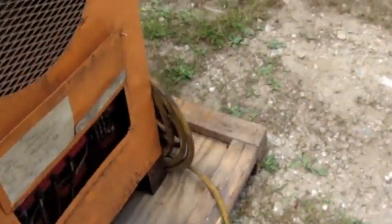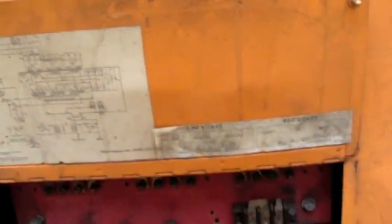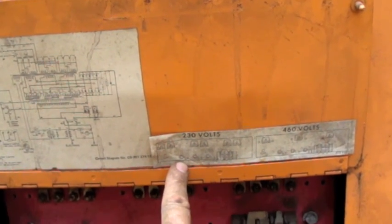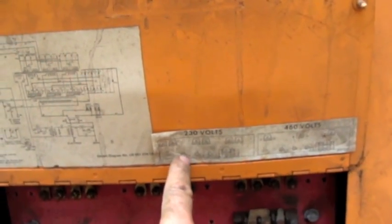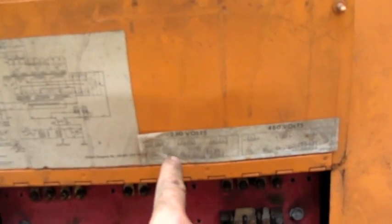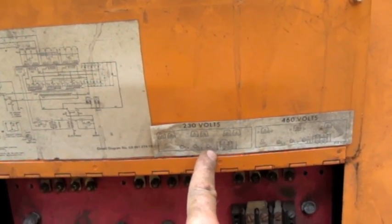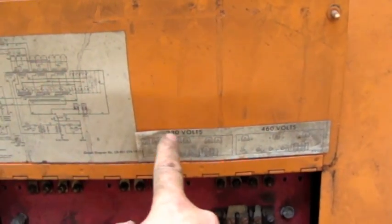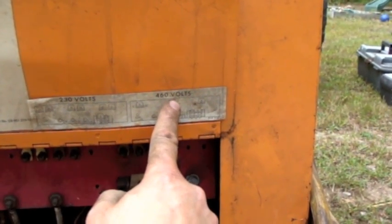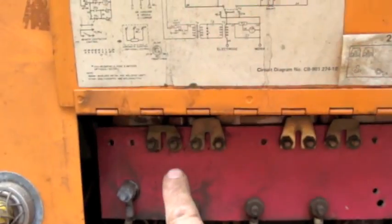It's funny - I said I didn't have a schematic diagram for this unit, but it's right here on the inside of the back cover. This tells you how to make your connections. This is also the dead giveaway that it was three phase - the fact that you've got L1, L2, and L3. If it's a single phase unit you'll see L1 and L2 and maybe a neutral, but not L3. This is the connection for the jumpers for 230 volt, and then you have 460 volt three phase like in a factory or commercial operation.